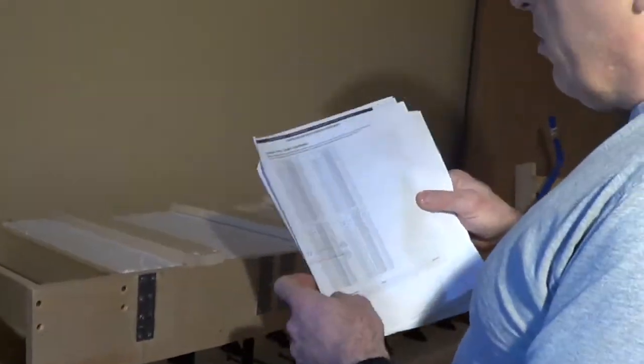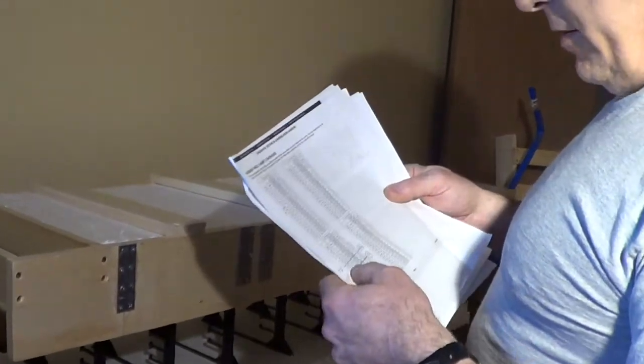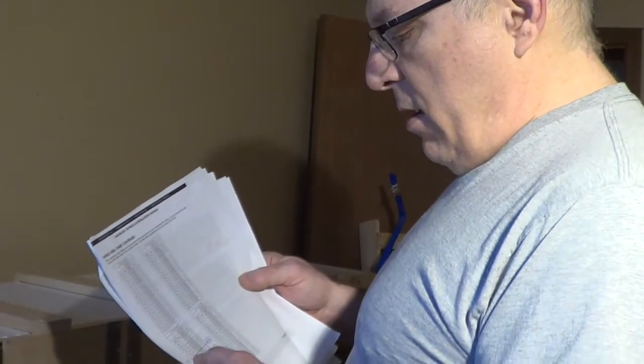There's one page in the instruction manual that gives you all the charts. So if you're doing a turret that's about seven feet in radius — about 14 feet across — it needs a cut of about two inches every foot. So that's what I have to take out. This was very precisely measured.